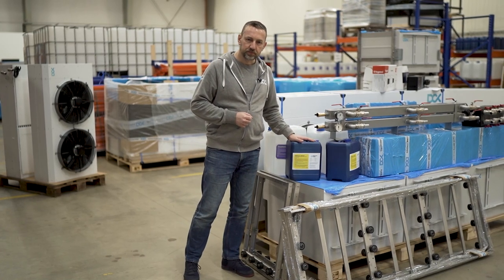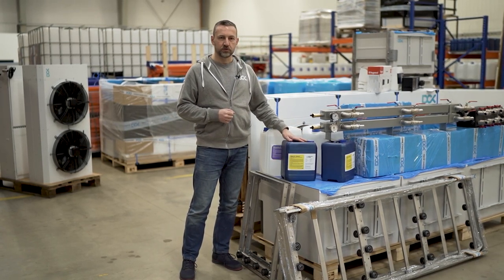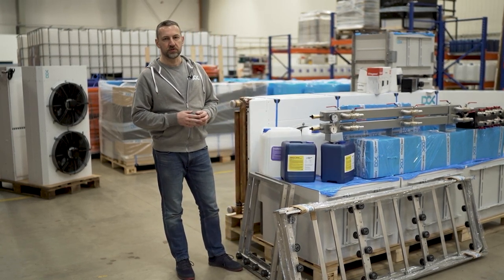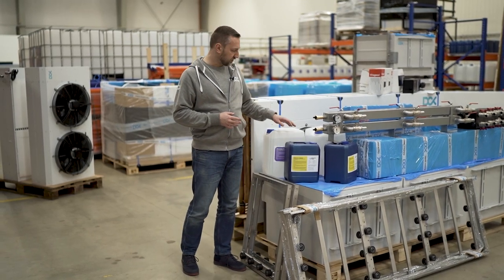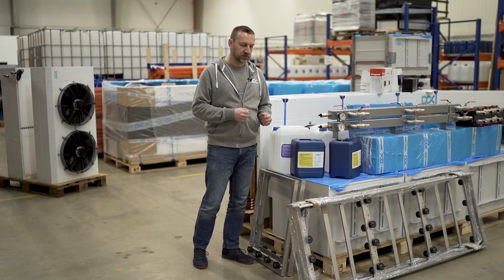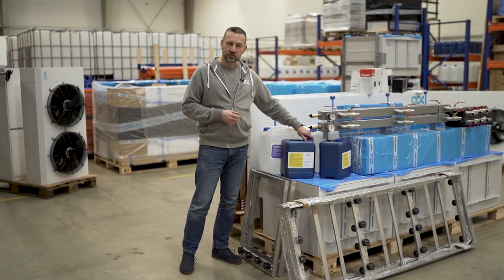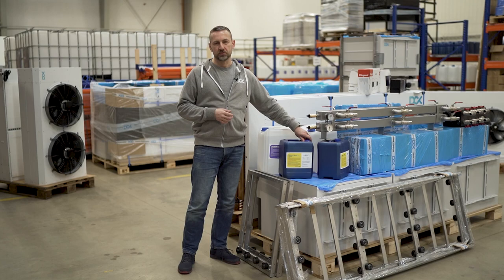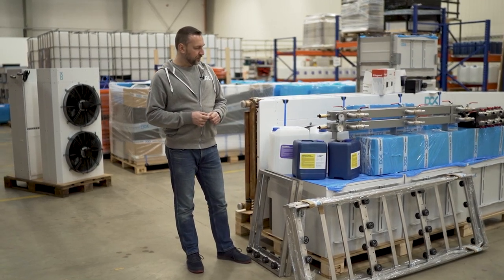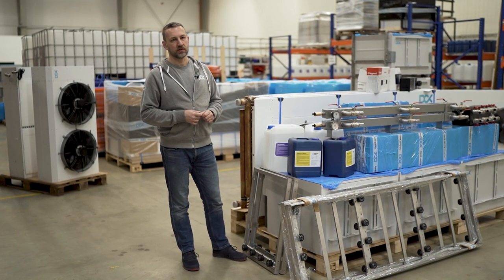And we have the solvents, which we normally distribute. And the solvents are meant for only one thing. If you ever have to remove your miner from the immersion, if you'd like to send it for maintenance, then you can use that solvent to emulsify that fluid and to remove any residue of the dielectric fluid from the hardware. So this is the only situation when we need the solvent. For the preparation of miners, we are not using the solvents. We don't waste that one, because that will serve you for long years also. And for the preparation of the miners, we would only use IPA alcohol, isopropyl alcohol, and that's the only thing that we need.